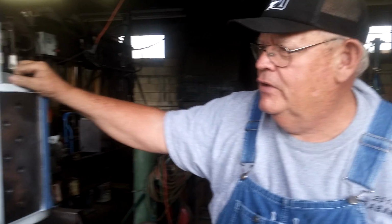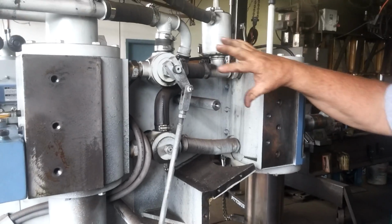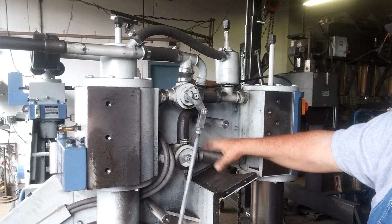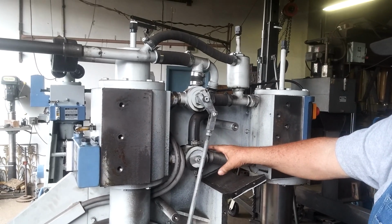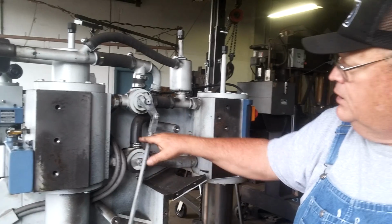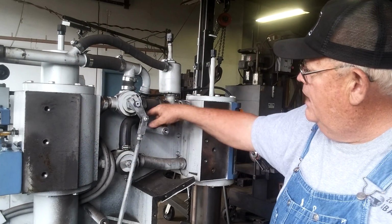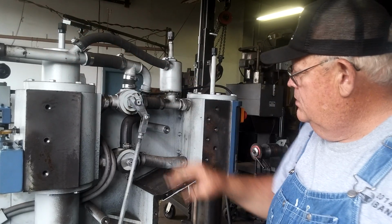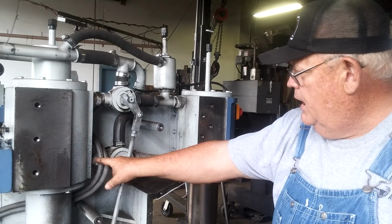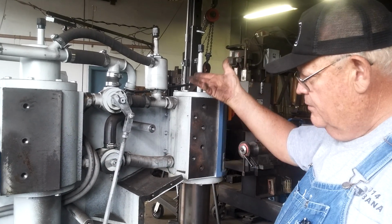We've taken the side off of this 50 kg. We're going to show everybody what happens when we're running this hammer. The valve on the other side for the no-load startup simply opens or closes this valve. So we either vent all of the lower air to the atmosphere through this valve, this hose, and out, or when we close it to the run position, no air exits, and 100% of the bottom air goes to the bottom of the ram to raise the ram.